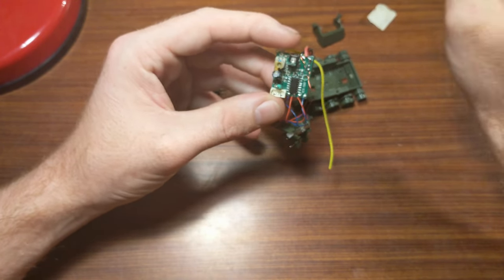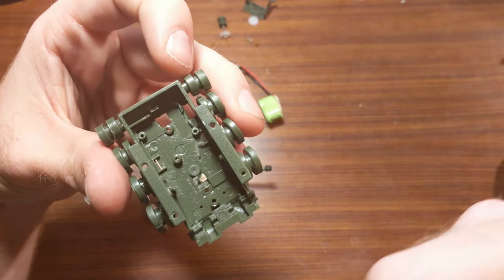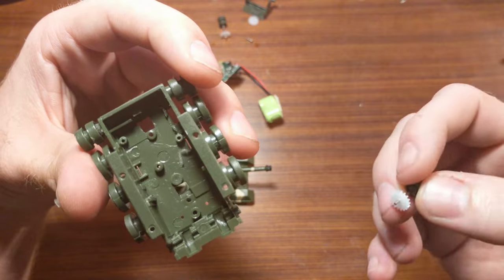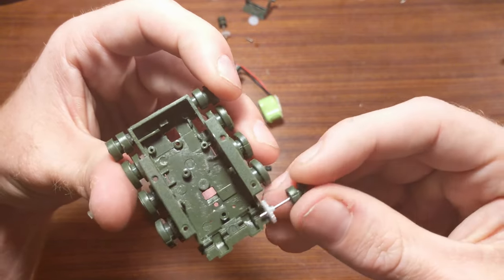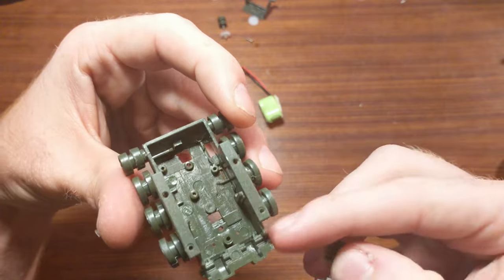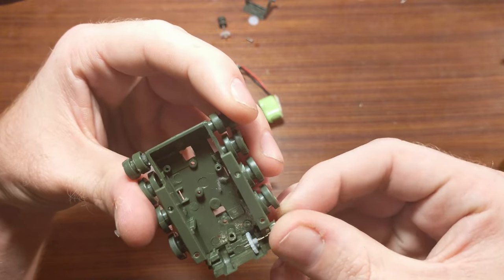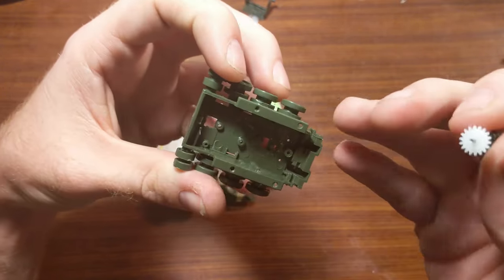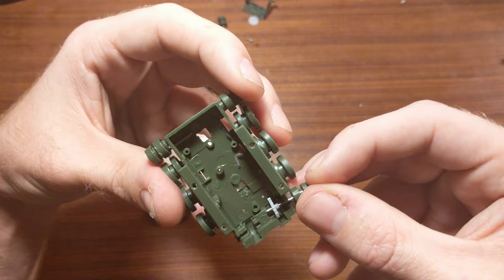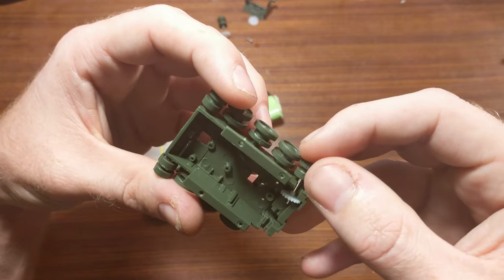As far as the drivetrain goes, this is obviously a small, very lightweight toy — probably weighs far less than a hundred grams all up — so you don't need ball bearings or anything special like you would in a power tool. All we have here is metal shafts riding in the actual case itself; the bearing surface is molded into the case of the toy and the shaft simply runs in those grooves. This is an example of incredibly efficient engineering where the body of the tank itself serves as part of the gearbox structure — pretty cool if you're designing toys as cheaply and effectively as possible.